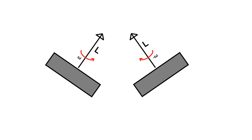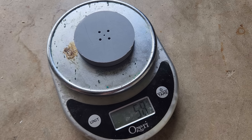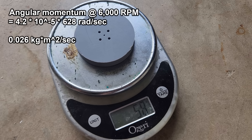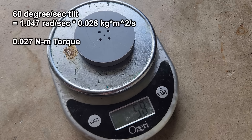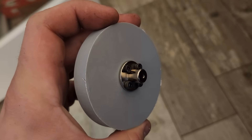To create a torque, you simply tilt them opposite to one another. I 3D printed this 3-inch diameter ABS flywheel to see if a 3D printed gyro would have enough angular momentum to work as a CMG. It weighs 58 grams, and when I convert the diameter to metric and do a little math, the moment of inertia comes out. So let's say it spun up to around 6,000 RPM — that gives us an angular momentum of 0.026 kilogram meters squared per second. Say you tilt that at 60 degrees per second; that comes out to 0.027 newton meters of torque. With two gyros, that would actually make it 0.054 newton meters — it seems like it might work.